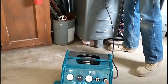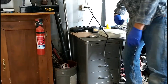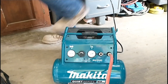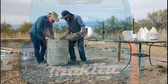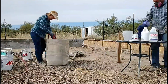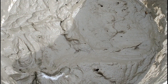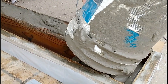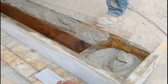We're going to be making a test sample of our standard mix and comparing that to a mixture with an additive. We ended up using a different type of Portland cement this time — everyone in town was out of the type 1 through 2 Portland we had been using, so we ended up going with the type 2 through 5 Portland cement. We were interested to see if it might actually work a little better, as it has a little bit different curing properties.